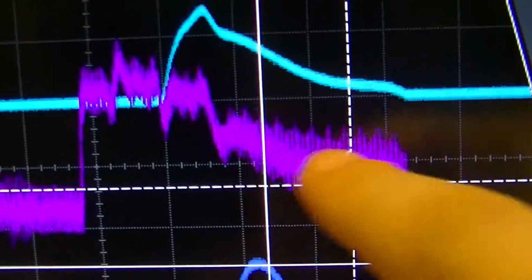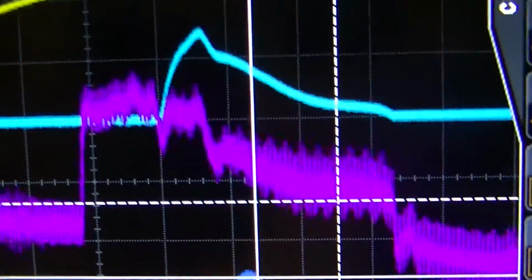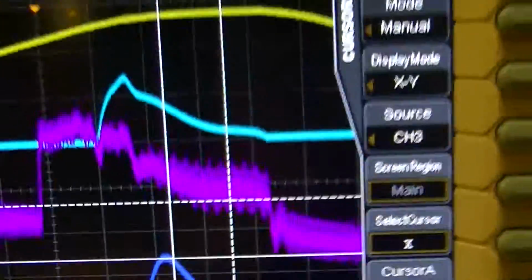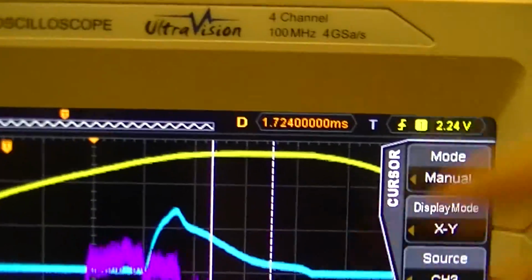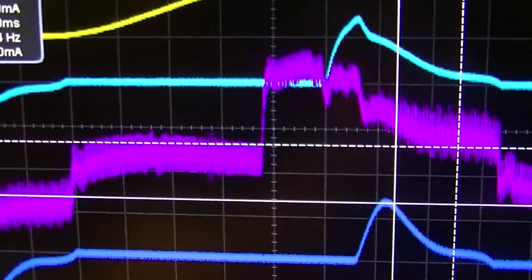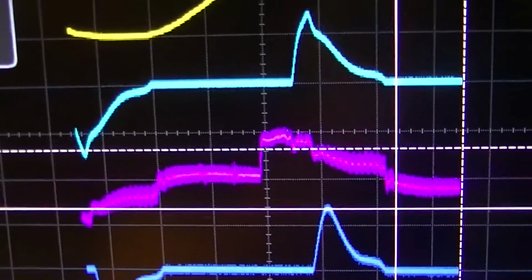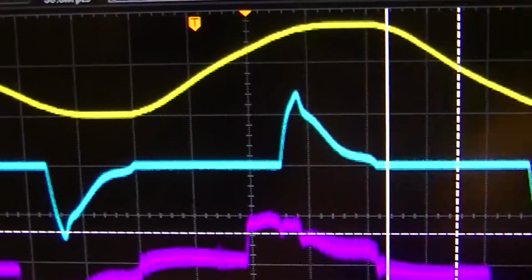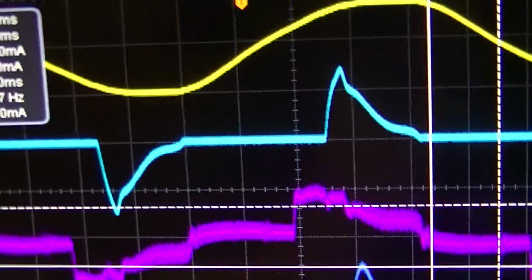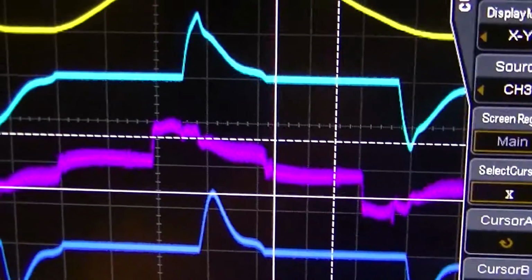Yeah, and again, as you can see from this, they're fairly unstable. These things aren't exactly the cleanest. But then again, when you think about it, if you're willing to deal with that, it's more distributed than what you get from compact fluorescents and a lot of cheap power supplies, where it's just this bang, bang, right where the mains levels off, hence the flat topping. Now I think a lot of that might just be an artifact of the transformer, because I'm running it on a transformer isolated supply. For safety reasons, obviously, because otherwise one of these would be at ground level.